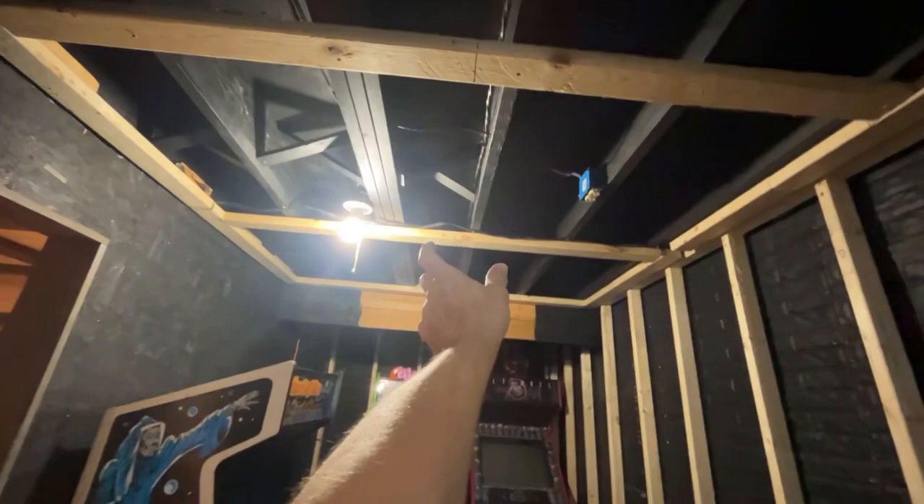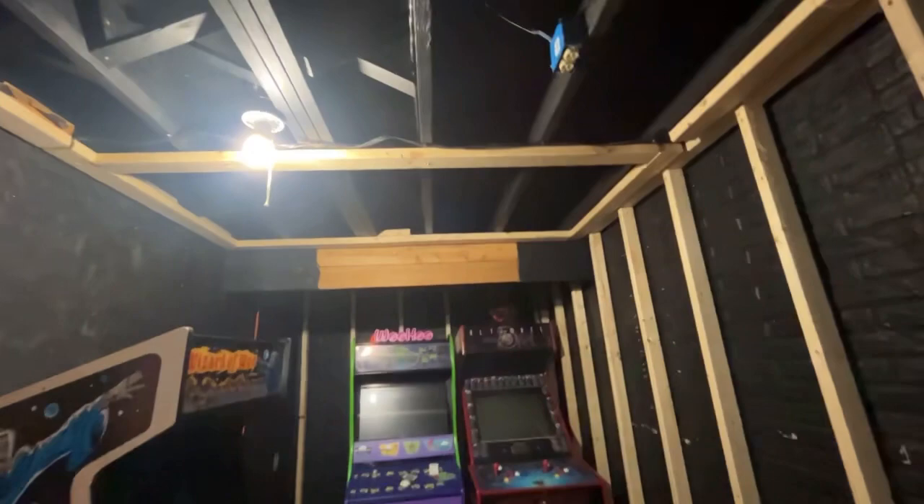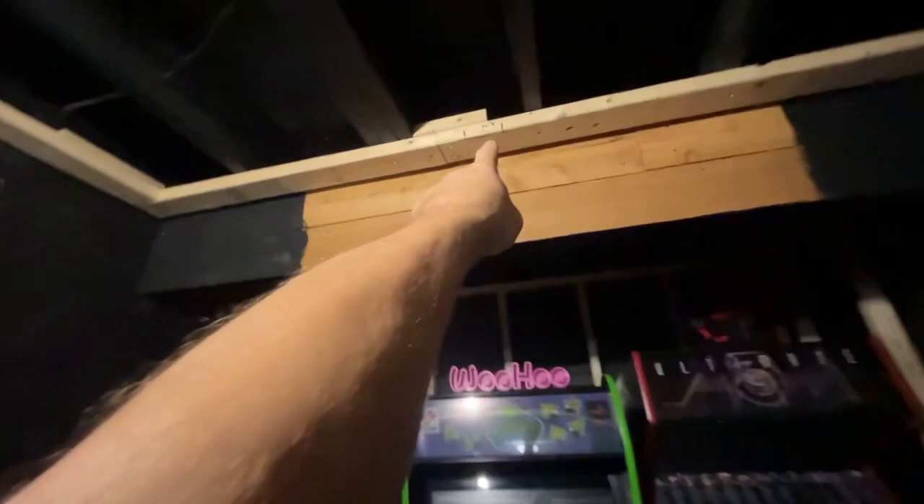I have these cross ones in now. By the way this works out, I'm actually just going to put one down the center because one down the center is going to give me almost perfect squares on each side — it's like 36 and three-eighths this way and 36 and three-sixteenths this way, so it's almost a perfect square. Now if you look, I have an X — that's the center of the two by four area. The two by four edge goes here and goes over that way. I'm not going to put any between these two. I'm just going to take a long two by four that goes over top of all of them, going from this edge all the way across. I might have to put a little piece in — probably going to go from here to there and then a piece from here to here.